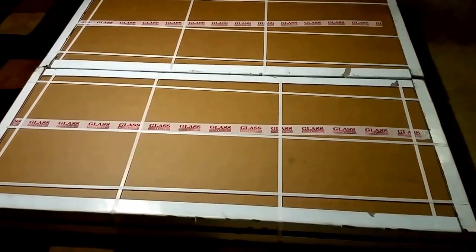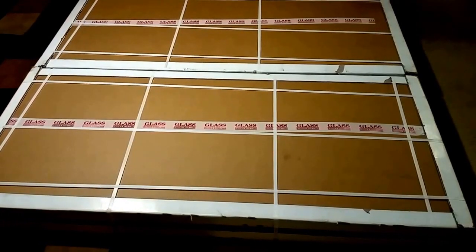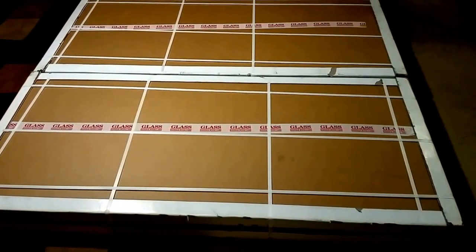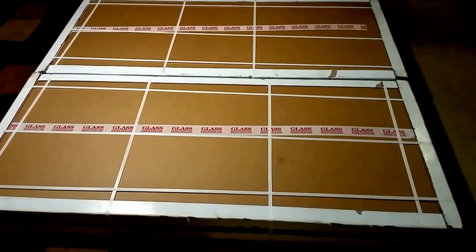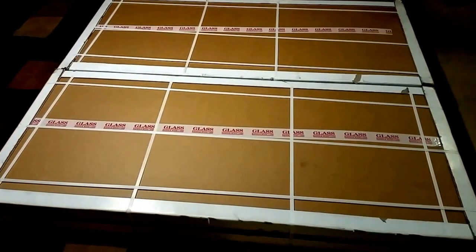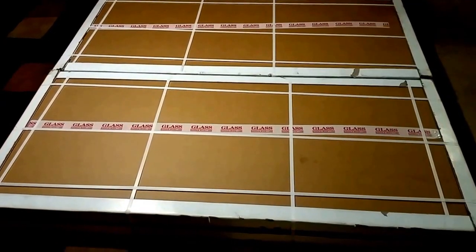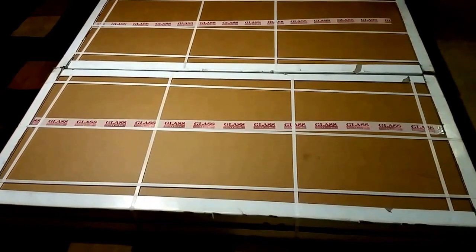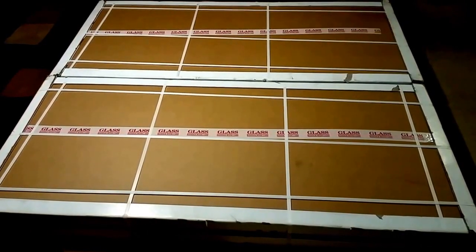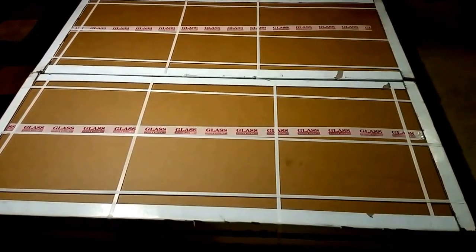These modules can produce a maximum power voltage of 18.73 volts and a current of 8.62 amps. The open-circuit voltage (Voc) is 23.2 volts, and the short-circuit current (Isc) is 8.95 amps. So these guys can really produce good power — for just a 160-watt panel, High-Tech Solar monocrystalline gives you 8.62 amps and a peak of 8.95 amps. This is awesome.